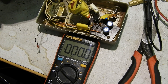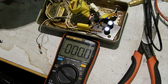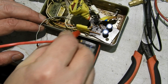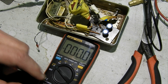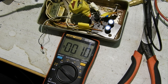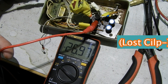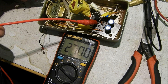I think the deal with these power supplies is they were like 15 volts in these amplifiers — 15 or 24, somewhere in that neighborhood. I probably wanted to get it down for this chip, so I probably got a heck of a voltage divider here, and that's probably why I used a light bulb too, to not dissipate it all in heat. I didn't have voltage regulators handy back then. Why am I getting nothing but I'm getting a spark? The meter is reading nothing but I'm sure I'm getting a spark. Let me clip that on so I get a good steady volt — I believe that's my positive. 26 volts! Probably safe to say I killed the chip.